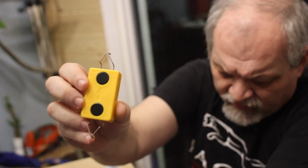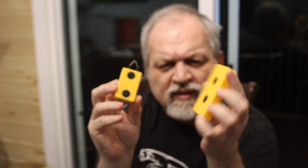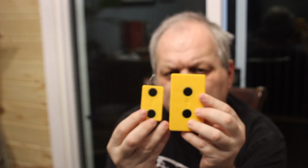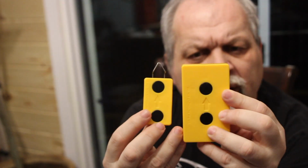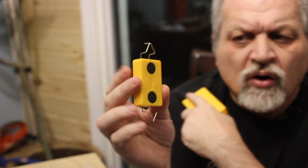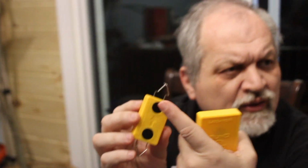And then you have a target. Those black dots are neodymium magnets. This goes to the receptacle, this is the target finding, and they both have arrows. Again, I don't know if it is visible or not, but they give you the right direction. So this is going on the receptacle itself, and then you put the material, drywall or any kind of sheet material that you're going to make your walls from, and then on the other side, this locks in, and then you just take a pencil, you make the line around it, and you can cut it.